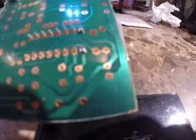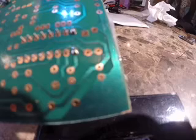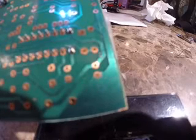I want to get these at opposite angles. And the reason why I'm doing it this way is so I can do the whole thing, and then when I flip the circuit board around, I'm not bumping into anything that I've already done. But that's what your finished look should look like. Hopefully you're getting that on view. Nice rounded little teardrop. I'll see you on the next video when this circuit board is done.